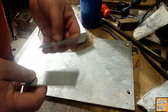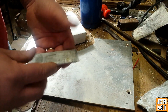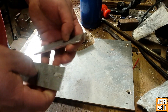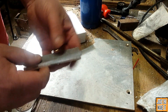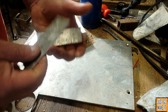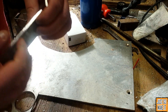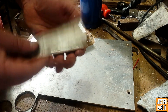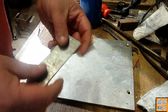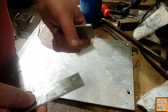I've got two little pieces here that I cut. They are very, very similar in size and they're both a good 1/8 of an inch thick. This stuff can be kind of hard to bend by hand. Maybe if you've got one of the brakes or something you could bend this easily, but with aluminum this thick, a lot of times I try bending it and it tries to crack on me, and that's just not good if you're wanting something to be strong. So let me show you how to anneal this and make it softer so you can bend it.